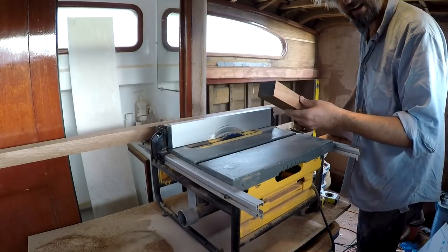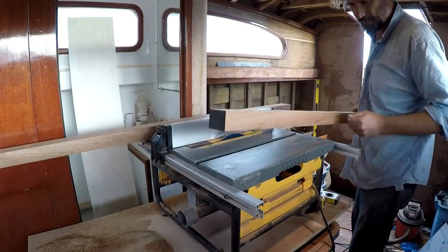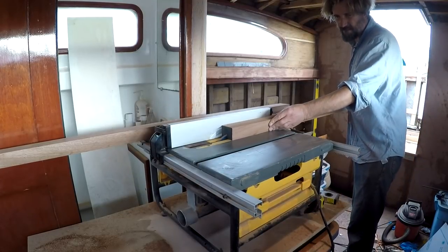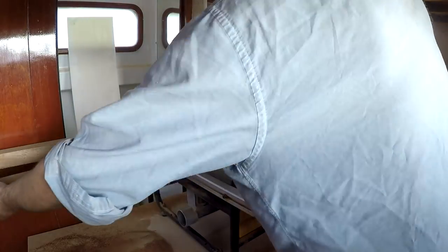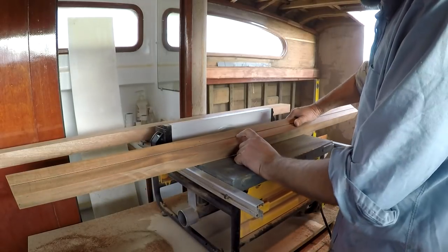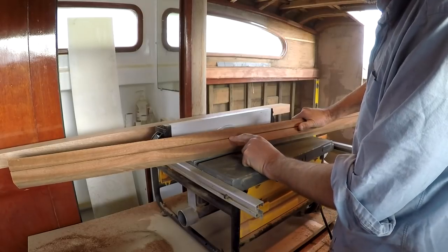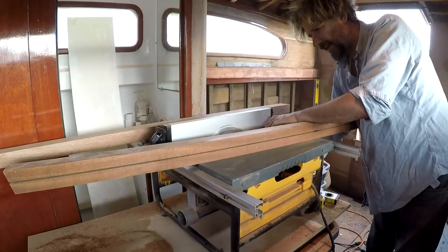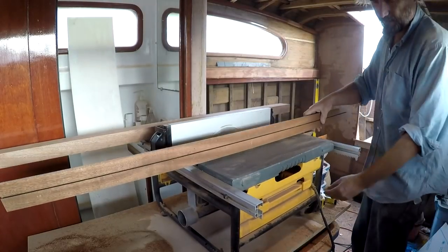So you keep trying — when you get close you try it and then you move the blade over just a bit. My initial cut was very close to the center because when I flipped it around it only slightly widened the slot. So now all I do is move the fence over roughly a little less than a blade width and keep cutting and flipping until I have three-quarters of an inch wide.